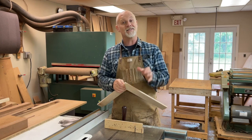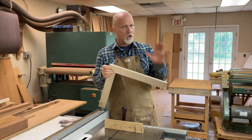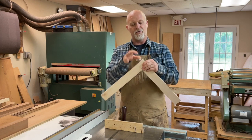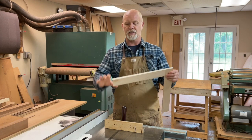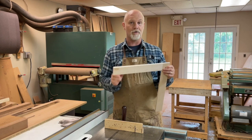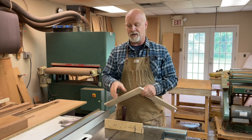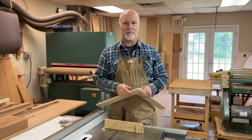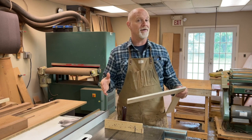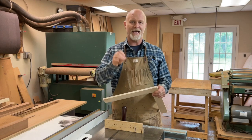The beauty of it is we just honed in on this joint, and because we final milled all of the pieces at the same time, this setting is going to be good for this joint, and this joint of this door, and then every door moving forward. That's the beauty of using a table saw when you have an opportunity. Not that this joint can't be cut by hand, because of course it can. It just means you're going to be starting over again at ground zero.